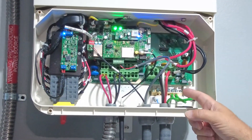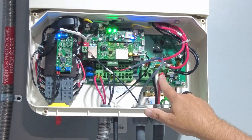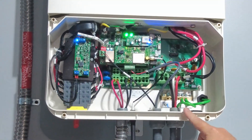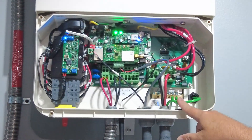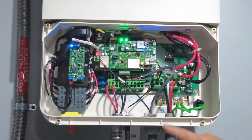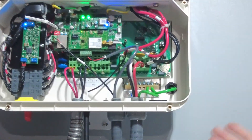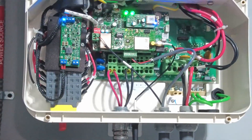Over here you have your AC voltage: Line 1, neutral, and Line 2. These all use ferrules, and I'll link in the description what I use to put the caps on the ends. Down here on the copper block you have your main ground, which goes back to my panel and interconnects with the grounds going to my panel. I also have one leg that goes up and grounds the chassis of the inverter — you can see it has a lug connected to the chassis on the back.